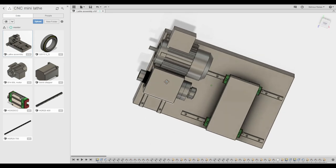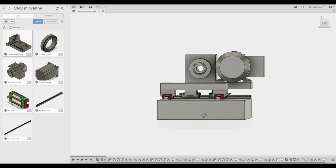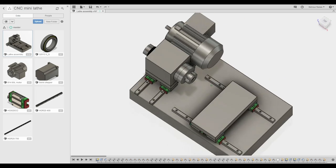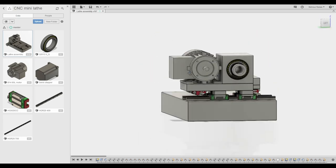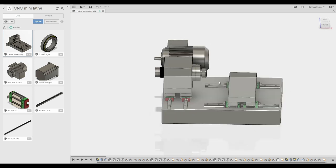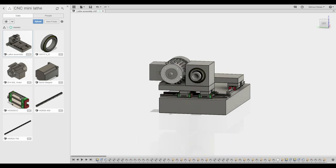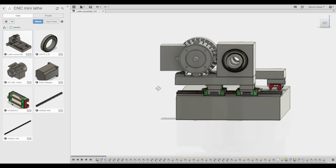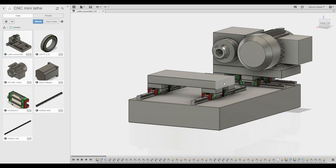This spindle motor is way too big. I don't have much of a choice because it's the spindle motor I bought for the VMC, and I'd rather not have to buy a new motor. Ideally I'd like to replace it with an AC servo motor — maybe a brushless servo or something like that. That would also allow me to do fourth axis and indexing. I've heard about people doing indexing with an induction motor and an encoder, but you'd need a brake as well since an induction motor has no holding torque. And you can't get fourth axis synchronised motion with an induction motor.